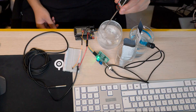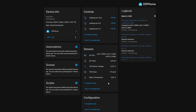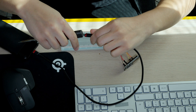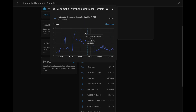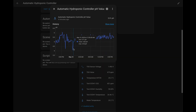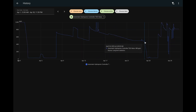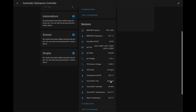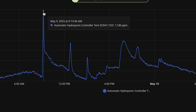Nutrients are key, but keeping an eye on pH and temperature really makes the difference. I was able to finalize this monitoring prototype while trying to understand what was wrong with the plant. Plants consume CO2 to grow — for reference, this is the scale used to define air quality. I finalized this unit — it records the value of each sensor every minute: humidity, temperature, and pH. During the growing process, the pH should be around 5.5 to 6.5. What's interesting is to see the nutrient level decreasing, and here the sensor was in the air as the water level dropped until the next refill.